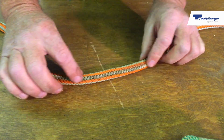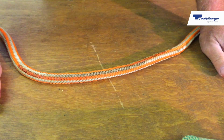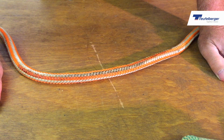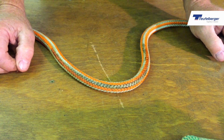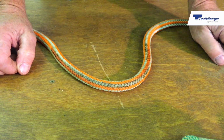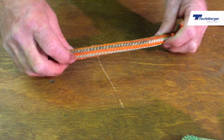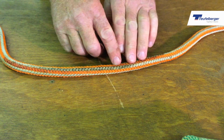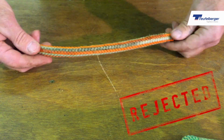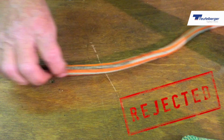The other thing that could cause glazing or this sort of damage to a rope could be some chemical damage. So never store your ropes with potential things to contaminate it, such as petrol, oil, maybe tree sap. Sap can have different effects on the rope itself. So watch out for glazing. If we find this and it was that bad, then yes, you'd want to retire the rope. So moving along,